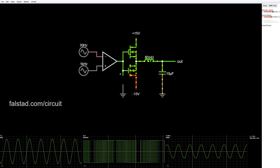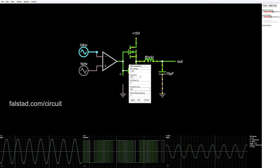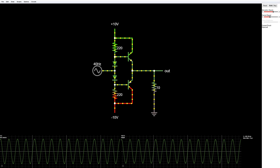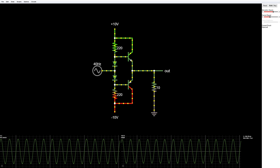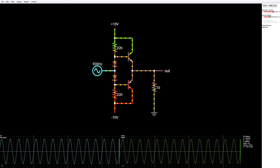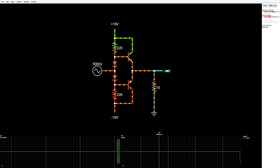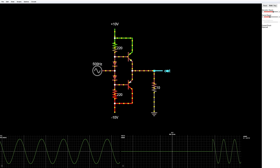By an integrated four-channel class AB amplifier underneath the board. These days class D amplifiers are probably the most common — they use pulse width modulation and smoothing to generate something close to the desired waveform with very good energy efficiency. For normal everyday plebs that's perfectly sufficient, but for an audio connoisseur like me, it is but an insult. A class AB amplifier needs a constant bias current even when inactive, has poor energy efficiency, and needs carefully selected devices if built discretely. In the little British monitors, it's all taken care of, and because we're not looking at huge monitors, the energy efficiency is negligible.